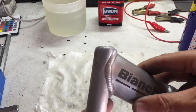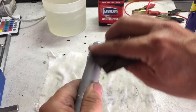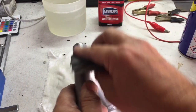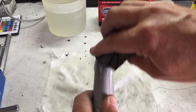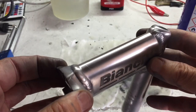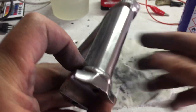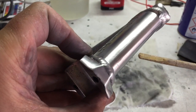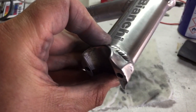There were one or two small mistakes — you'll notice those lines I'm pointing out. That was where the solution had reacted with the gaps in the masking tape, and I needed to work them out using wet and dry paper once again. This wasn't quite as easy as I expected though — those little etching marks were quite deep, and I eventually had to resort to a jeweler's file to get rid of most of them, and then once again work the stem with wet and dry paper. It was a tedious process, and next time I'll take much better care when masking it. Here you can see I'm just showing what those lines looked like after sanding — it was at this stage I realized I needed to go a little bit more aggressive to get rid of all of them.